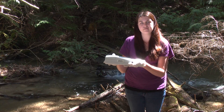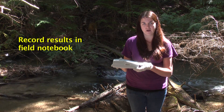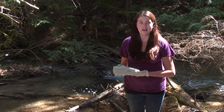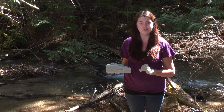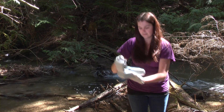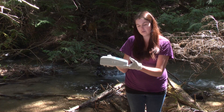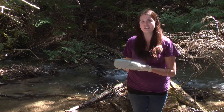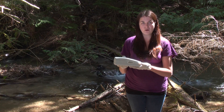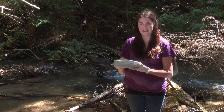This sample is reading at 1.5 milligrams per liter. You want to make sure that you record that number in your field notes. Once the second sample is ready to be read, you want to make sure that you zero out the DR-700 again. Then you put your second sample into the DR-700 and press read. This sample is coming out as 1.3 milligrams per liter, which is 0.2 different from the first sample — that is accurate enough for this reading.